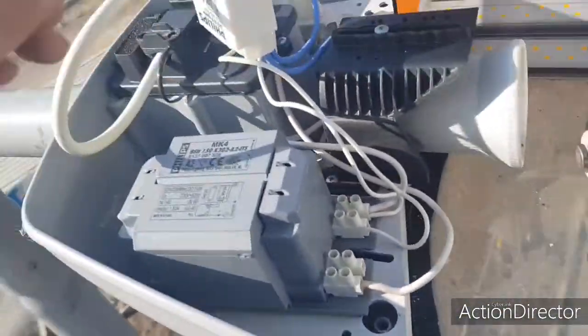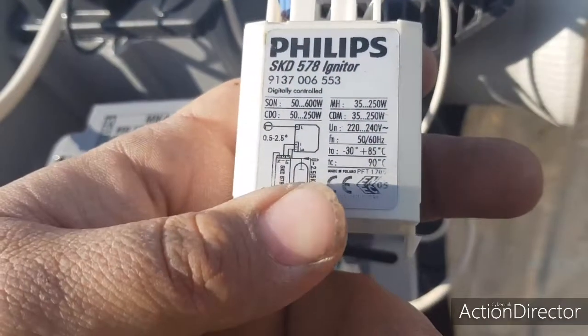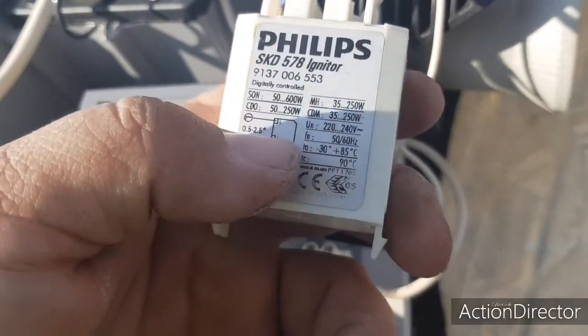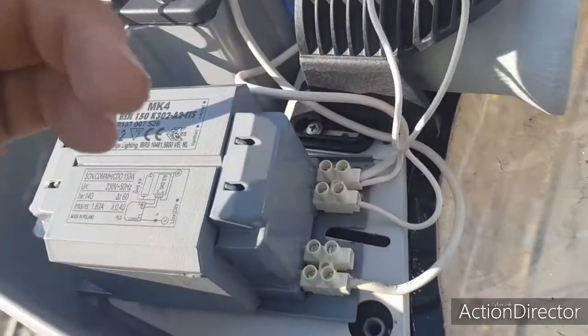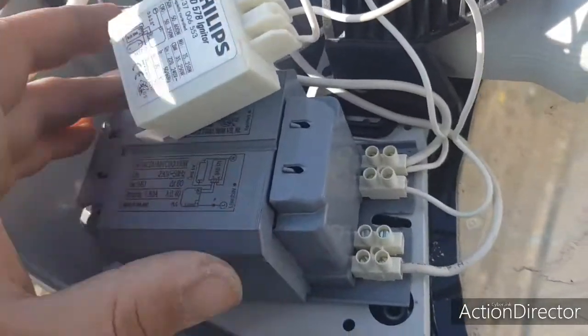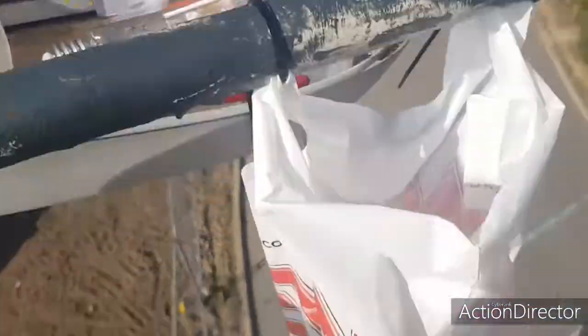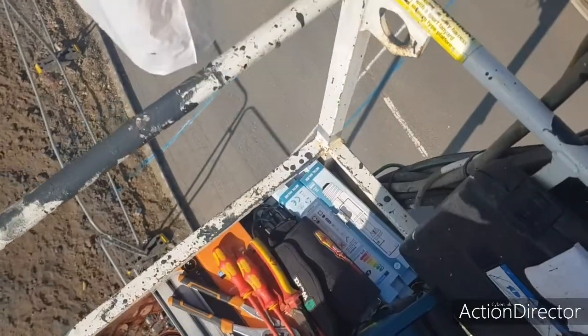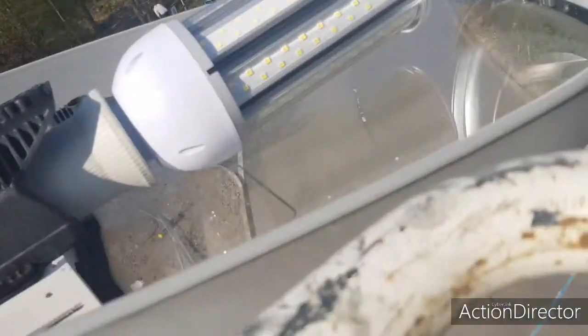It took the cutout fuse as well. I thought it smelled a bit funky when I pulled the lid. This is only rated for 250 watt, but the ballast has obviously been fried. So LED it is - ballast and guts removed, LED lamp in, close the lid down.